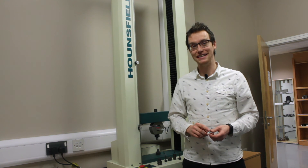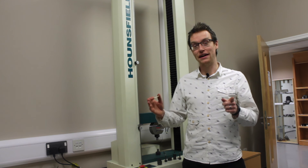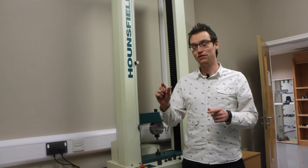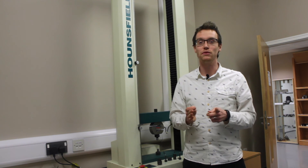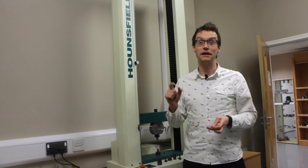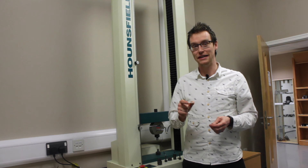There we have it — just to show how important it is to look after the basics. Without taking care of the amount of hang out of the chuck, with about 15 times the diameter hanging out, you're getting 0.3mm error across the workpiece. Bringing it back to 3 times the diameter, and you've got it down to about 0.01 to 0.02mm. Looking after the basics is absolutely key.